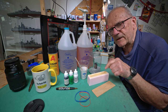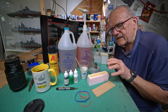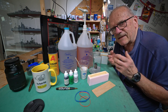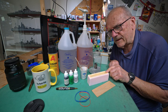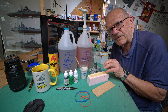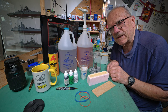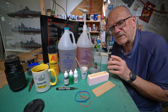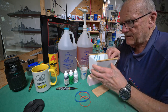Before that, I put it in the vacuum chamber and extract all the air out of it — at least as much as I can. There will be tiny little bubbles of air here and there that just don't expand and escape. Then I'll put it down in the pressure pot in the workshop and do the complete opposite — instead of vacuuming, the air will be compressing whatever's left in there to probably about one-eighth the volume it normally is. When the stuff cures, the bubbles are a little bit smaller — that's the whole idea.